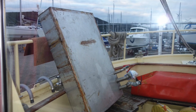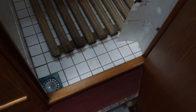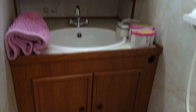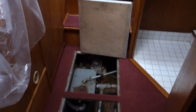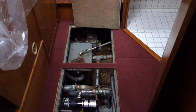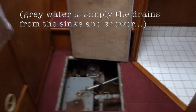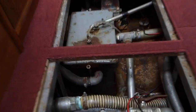Now you may remember the removal of the black water system. The shower is here and that water — that drain — has to go down of course. The sink is right at the water line, the bottom of the sink, and that's true for the kitchen sink as well. So I've got three drain paths that all have to go down. They call that gray water — normal drainage water. And in this boat, some Einstein decided to weld it to the hull.